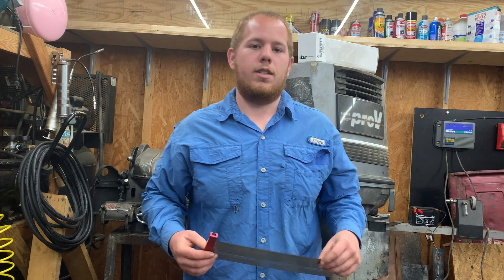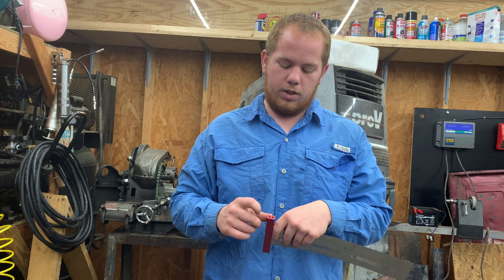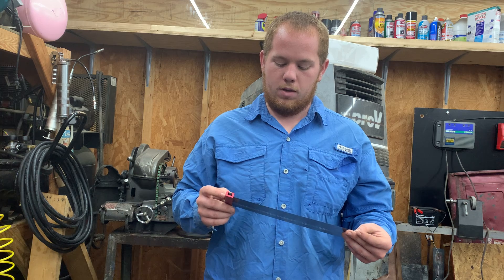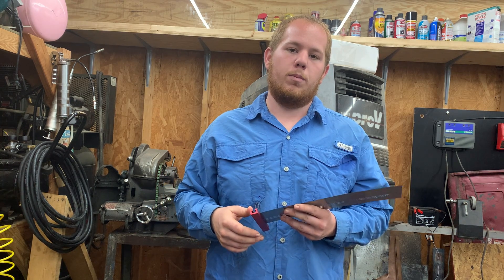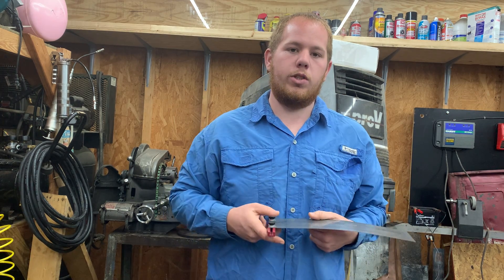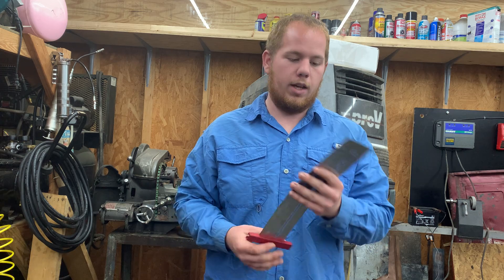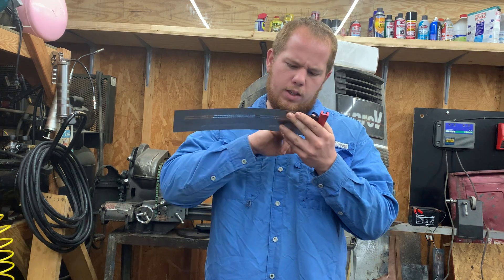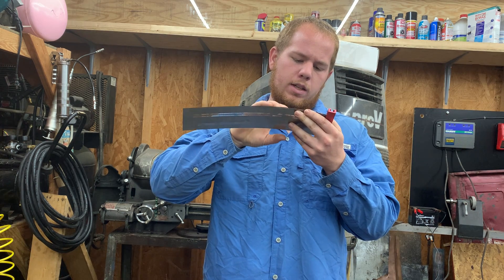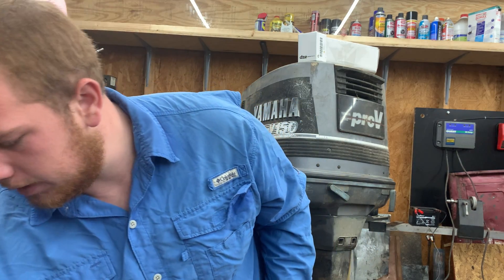Next up is what I call a marking roller — it's by Incra Rules. It's a painted aluminum T-channel. You use a 0.5 or 0.7 mechanical pencil in the holes and pull or push it along the straight edge to mark a line. It goes to 1/64 of an inch and up to 12 inches. It has a measuring system from zero to three inches and also includes millimeter graduations.